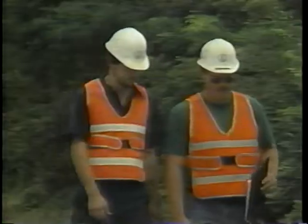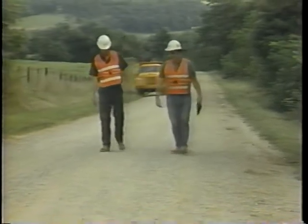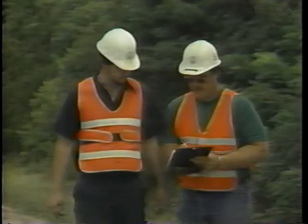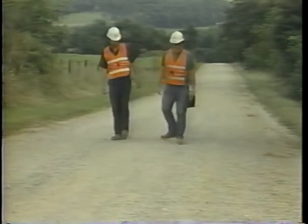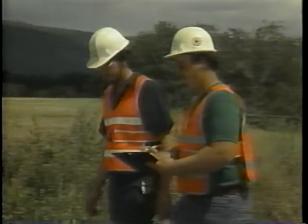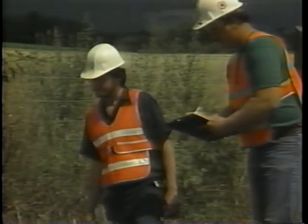Re-graveling is a major operation which involves many workers and pieces of equipment. It is essential to have good planning and coordination with your maintenance engineer. Schedule re-graveling during good weather — too much rain will delay the operation. Before re-graveling, repair soft spots, deep holes, and large depressions. For further repair information, refer to the IRF videotape on patching unpaved roads. Clean all ditches and culverts before re-graveling; good drainage is essential for a long-lasting repair.